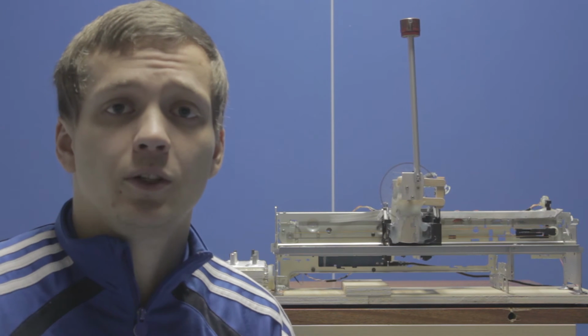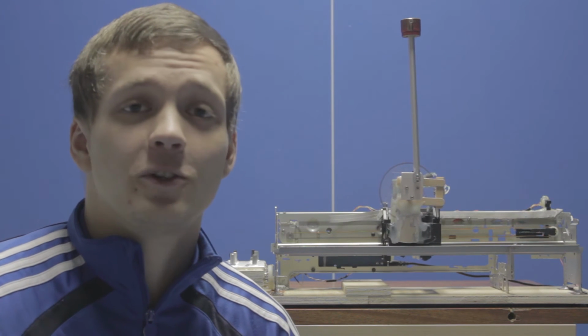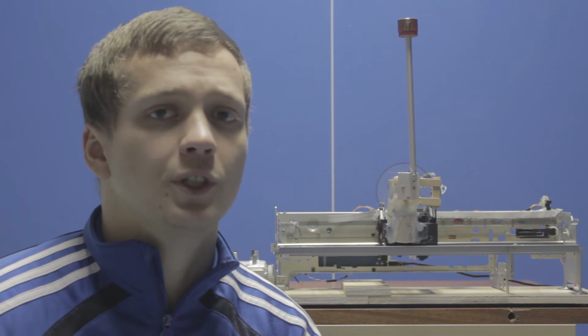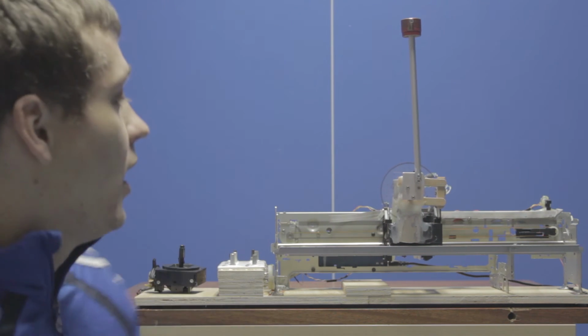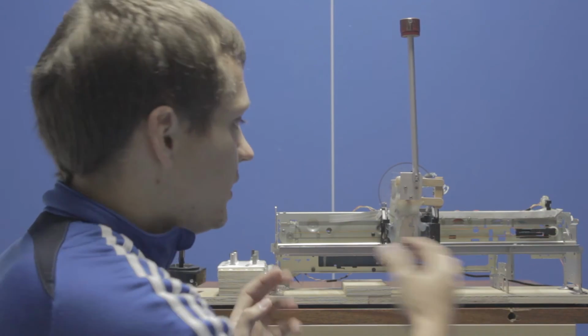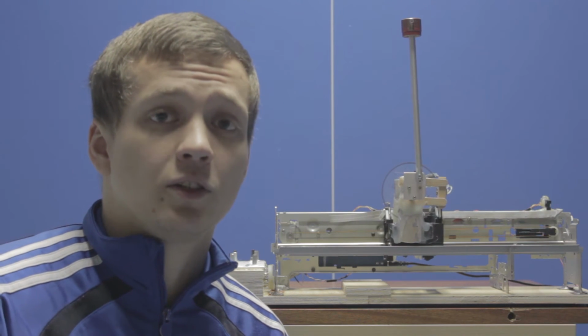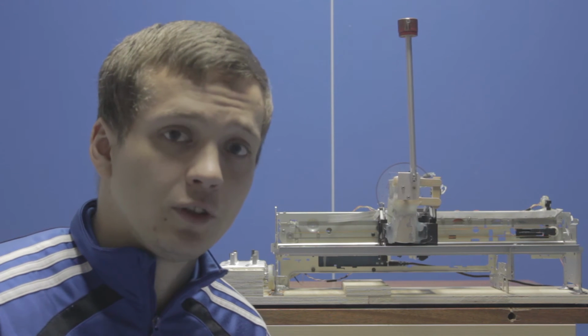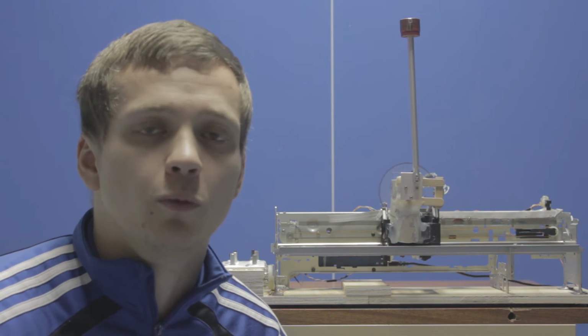And so the problem you're facing here is, in theory, what you should do is increase the D gain. But if you increase the D gain, your pendulum just goes nuts and it doesn't work. So what the problem basically comes down to is the relation of the resolution of my linear measurement and the fast sample time. So I have a linear resolution of about 9,000 steps over the whole length of this pendulum. So let's say 9,000 steps over 25 centimeters. And I'm calculating the linear speed by using the last position and the current position divided by the time span that has passed, those 2 milliseconds.